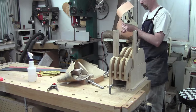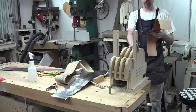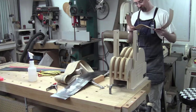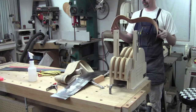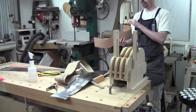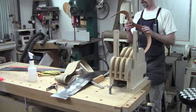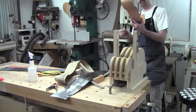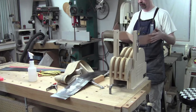Part of the reason I thought I had spring problems was I think because I was bending too cold. But clearly 260 worked for this. I'm impressed as hell. Now I'm going to go try it out in the outer mold and see how it sits. That was easier than I anticipated - I expected more trouble than this. 260 worked. I could probably do it hotter if I needed to.